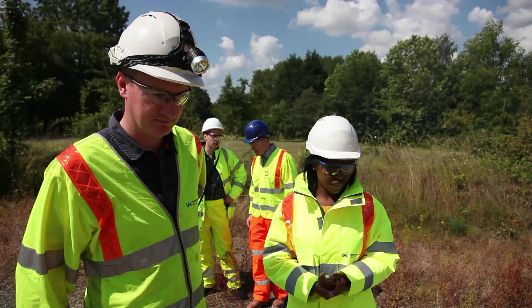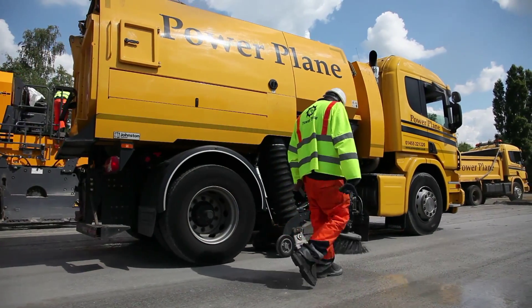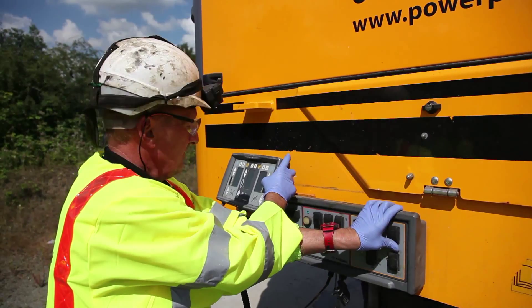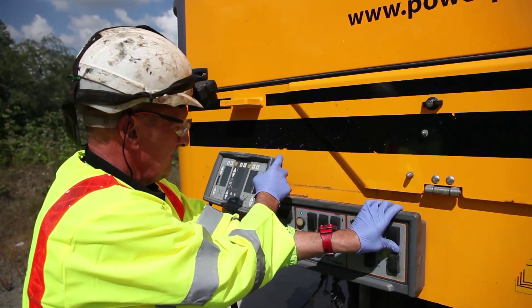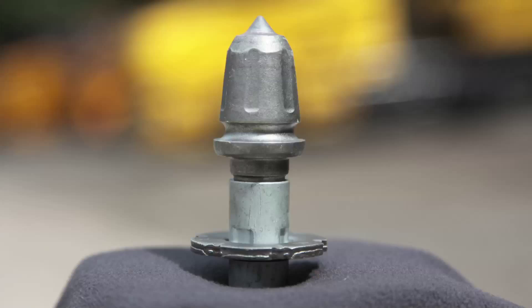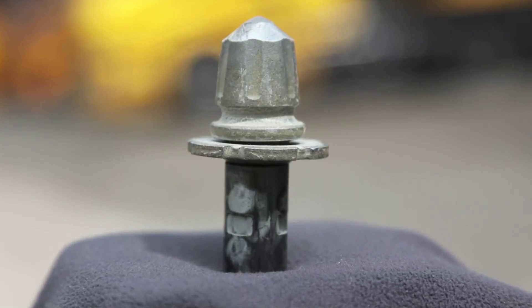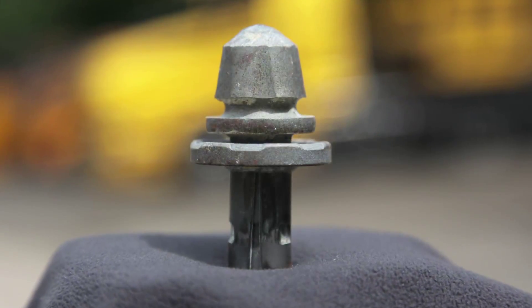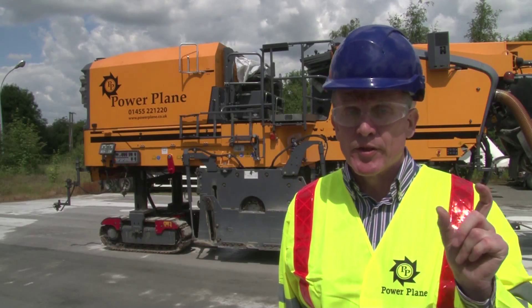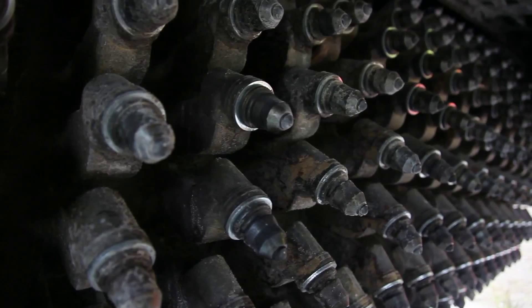The thinking behind the diamonds is that because the tip stays the same, you always get the same groove and a consistent finish — and that is the way forward as far as we're concerned. After three metres of carbide, the texture starts off as a pencil point but then you end up with a crayon, and worse than that it becomes completely bullnosed. With a diamond pick you're keeping the profile, and that height difference from the tool holder to the tip maintains throughout its life.